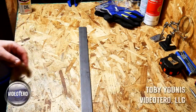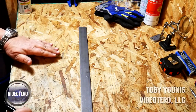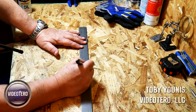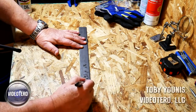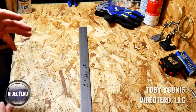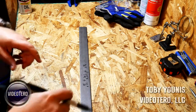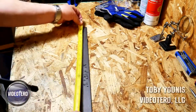Let's go about making our crossbar. What you're going to start with is a piece of flat welding steel. This particular piece is 36 inches long by 1 and 1-quarter inches wide by 1-quarter of an inch thick. I'm going to highly recommend you use the 1-quarter-inch thickness rather than 3/16ths, because as you get into heavier equipment, you don't want any flex. The 1-quarter-inch guarantees there's not going to be any flex. The first thing we're going to do is cut it off at 18 inches.